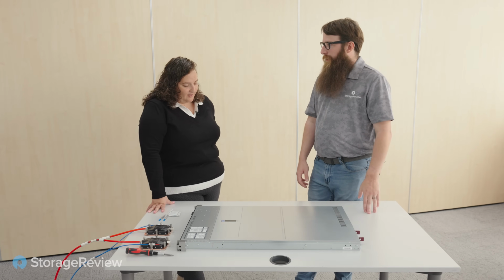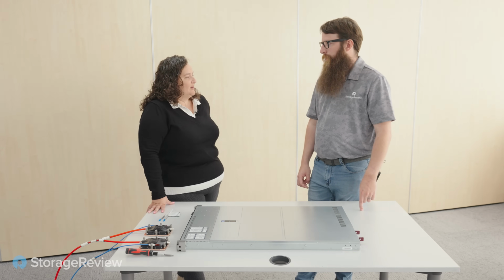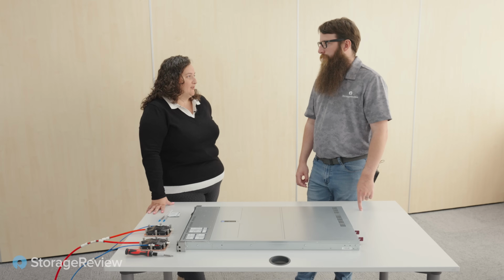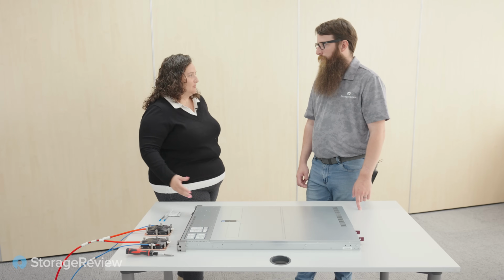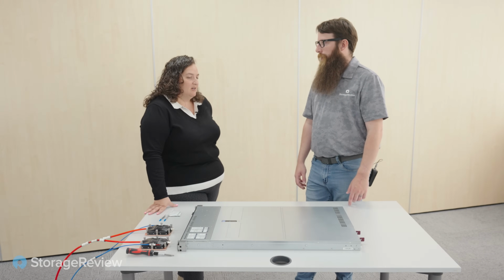Yeah, so first of all, for us, the amount of TDP almost doesn't matter. What really matters is the amount of TDP compared to the area it's on. So the heat flux, actually. For example, if I put 1 kilowatt on this whole table, we could cool it easily. But if it's on a small chip, it's obviously much harder.